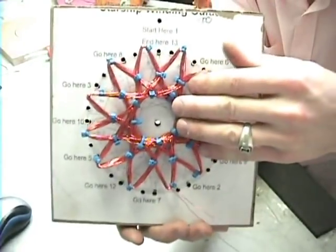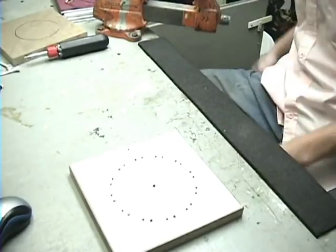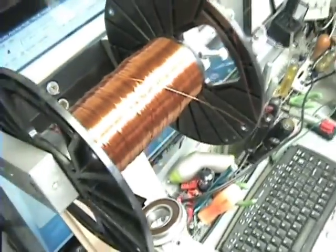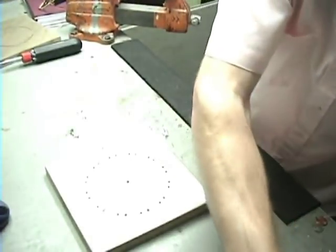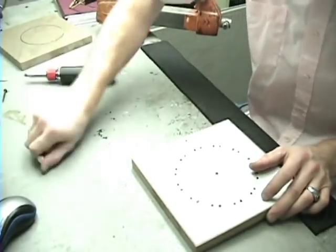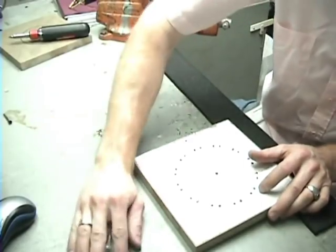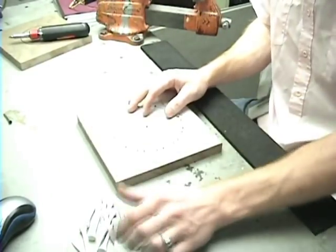Alright, let me get it set up. I just glued it on here, printed it out, glued it on here, and that's what size of coil I got. Now I'm going to show you a trick — at least one I've found to be a better or easier way to do this as far as winding goes. Most people — HHO for Volts originally started using golf tees, works pretty good. I still use golf tees; some people use nails and all sorts of stuff, but right now it's just golf tees. So I got my jig, I got my holes drilled out so my golf tees fit right in there, they're real snug. That's the winding jig.